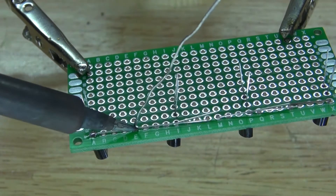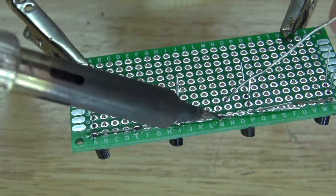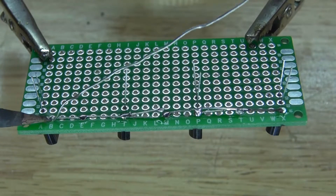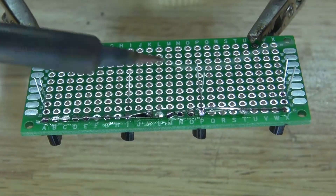Next, I'm going to take some bridge wire and place it just like this, and take some more bridge wire and place it like that. Then I'm going to go ahead and solder the emitter into place, solder the bridge wire, and solder bridge all of the emitters.